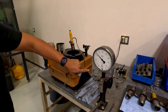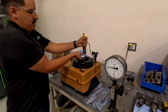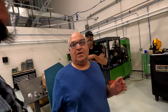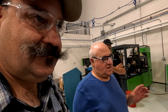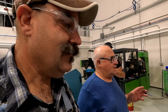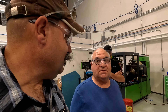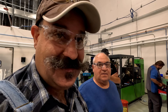I've verified it is 1500 PSI is the bottom line. He says if you can set them up at 1600 on the high side, the pintle height is seven thousandths. So the good news is here on the test bench, out of the six we have four good ones, but we have two problem children — the ones that we were trying to use before.